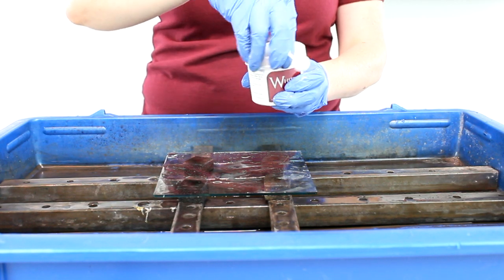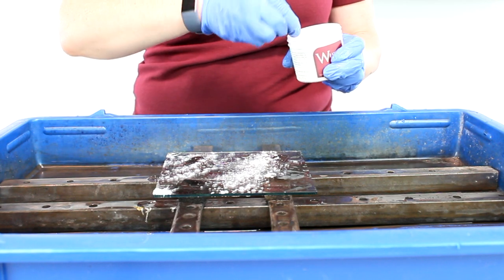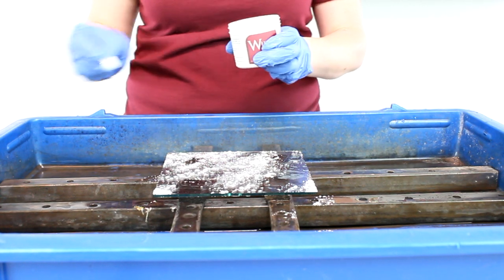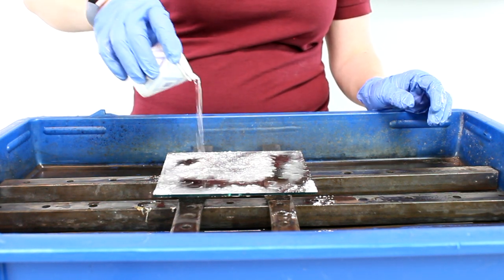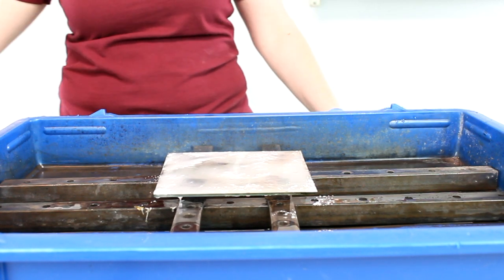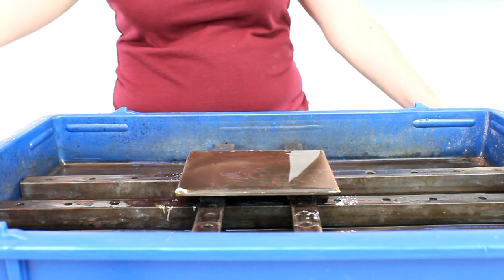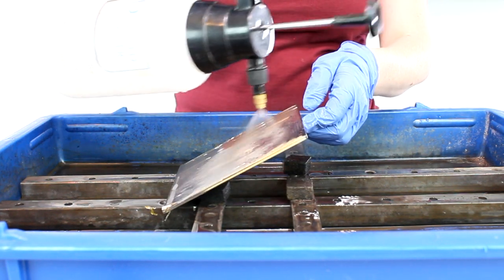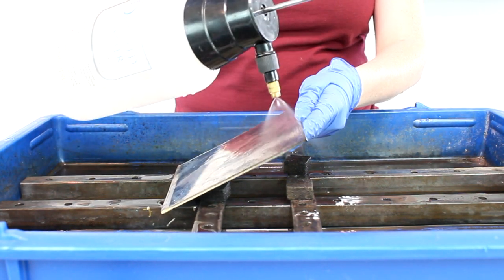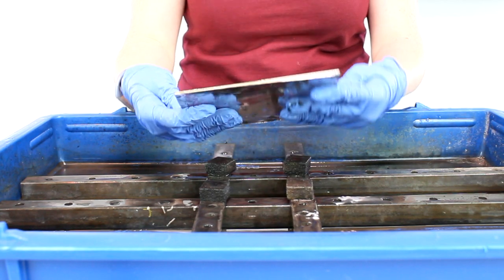For our first process, we are going to be sprinkling the whiting directly over the tin surface before there's been any silvering. Just sprinkling a pretty generous amount. You'll notice with whiting we go through more product than with some other antiquing products, because it's going to be acting as a physical barrier — it's not chemically interacting with the silver. Now I've got my combined pouring silver chemicals that I'm pouring over the surface. You can see they're appearing cloudy because of the whiting on the glass. I'm going to leave it without rocking, allowing it to fully deposit for five minutes. After five minutes, I'll rinse off the glass, making sure to get any residual whiting off — that can interrupt the paint's ability to adhere properly. You can see where it had an effect.